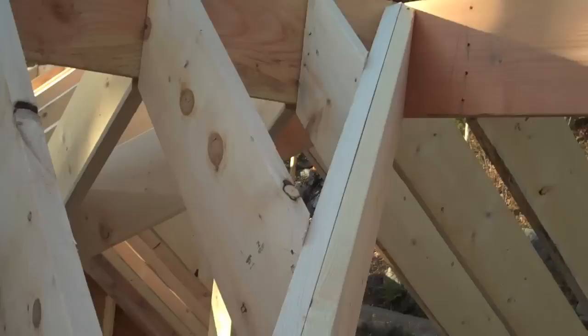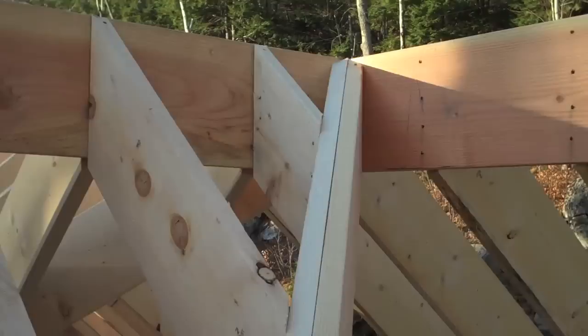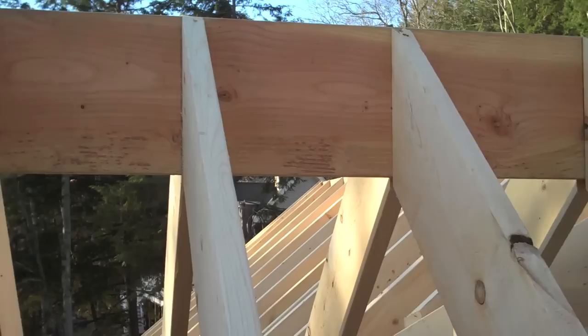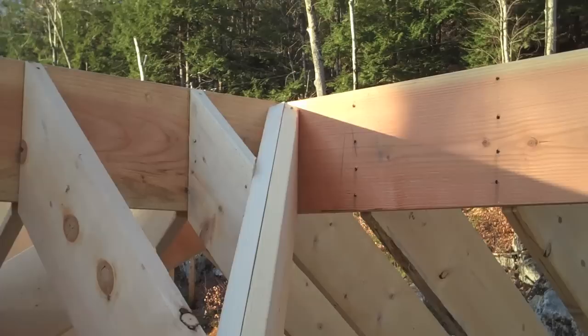This is common roof framing that's being done, not trusses. Look what you see here — this is actually the main ridge beam of this house. It goes a long, long way all the way down and continues in that direction for another 20-25 feet. Here's another ridge beam, and it comes across this direction and ends. The point is, where these two intersect, you have to have a valley rafter.